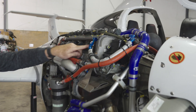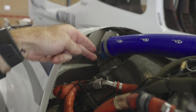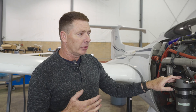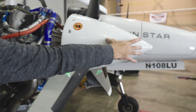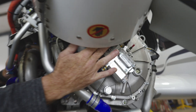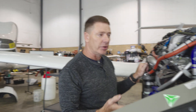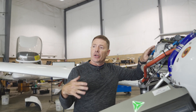The fuel injectors are here, controlled by the FADEC. We have an engine oil cooler beside the intercooler on the same air duct. That's for engine oil cooling. We have a feathering propeller on this airplane — the only thing that holds this propeller from feathering is oil pressure. Above 1,300 RPM the propeller rides on a spring in the front of the prop and oil pressure to maintain the pitch that the CSU (constant speed unit) is asking for. The CSU tells the prop how to pitch it for the FADEC — less oil pressure means more angle of attack for cruise; more oil pressure means a flatter pitch for climb.